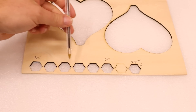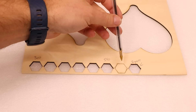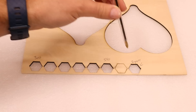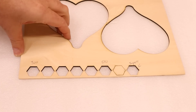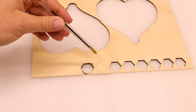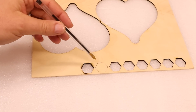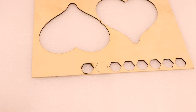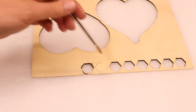What we can see is that it cut clean all the way up to 550 millimeters per minute, and it didn't quite cut through at 600. One result I had set to multiple passes, so it's essentially void. As I say, it didn't cut through at 600 millimeters, but if I flip this over, we can see it nearly went all the way through. So actually it wasn't that far off — a speed somewhere in between, say 575, probably would have cut through. We can also see that there's very little overburn on the backs of these cuts, which is pretty nice.